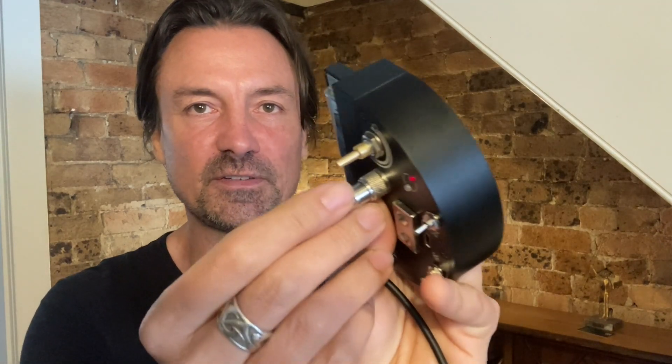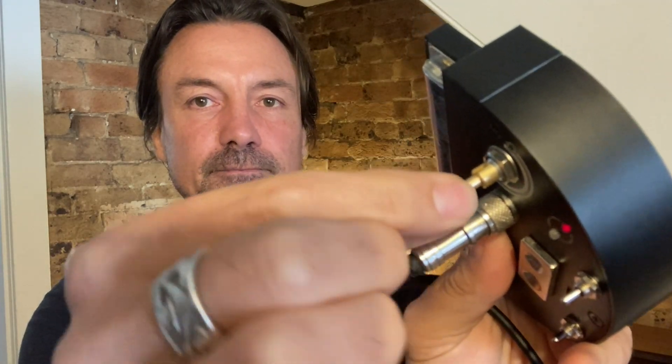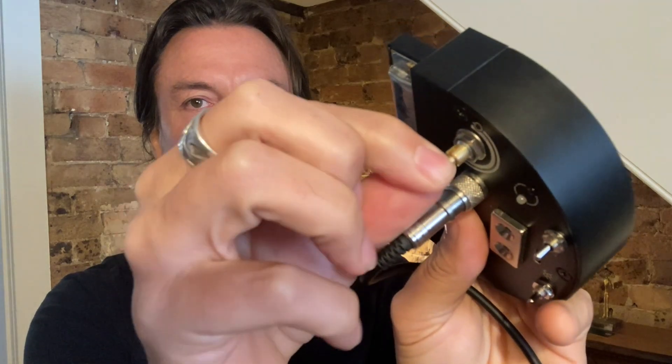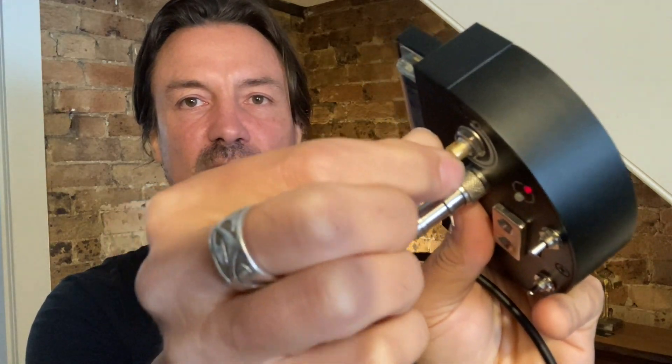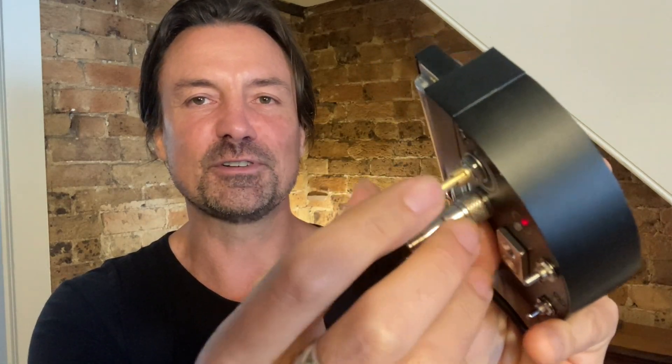Now that's the hand effect. I'll show you how the overdrive is working — that's with a split shaft pot. I've taken the knobs off here so I can show you close up. Here we have our volume, which is also our power — if you turn it off, you'll see the power light goes off. And then on top of that is the drive control, and that's how we tailor that. Of course there are knobs on there so you don't have to fiddle, but I wanted to show you what's going on.